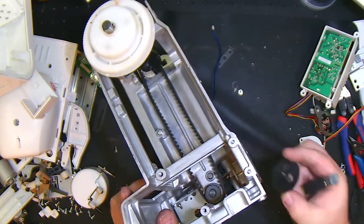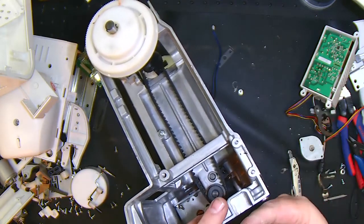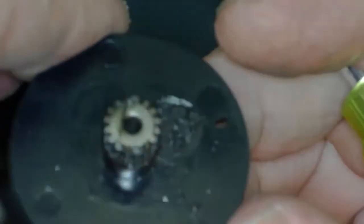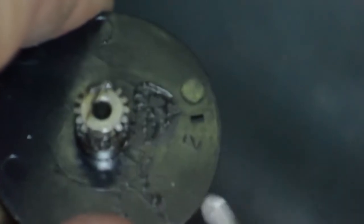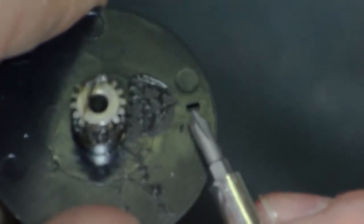Right, here's, dropping stuff. Here's the optical encoder that was on that one. And there's just this tiny, tiny, tiny hole. We need to zoom in on that, I think. Where is our, right there. So here is our shaft with the optical encoder, and the optical encoder is that tiny, tiny rectangle. You can't really even see it except if I get the light just right. Right there. Right, that's what this thing is spinning around and locating. So it probably locates it within a degree. Well, a couple degrees. That's a pretty big hole.